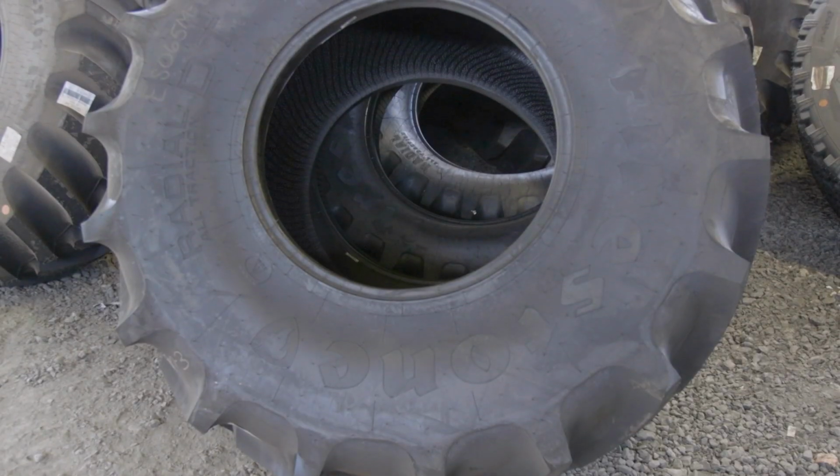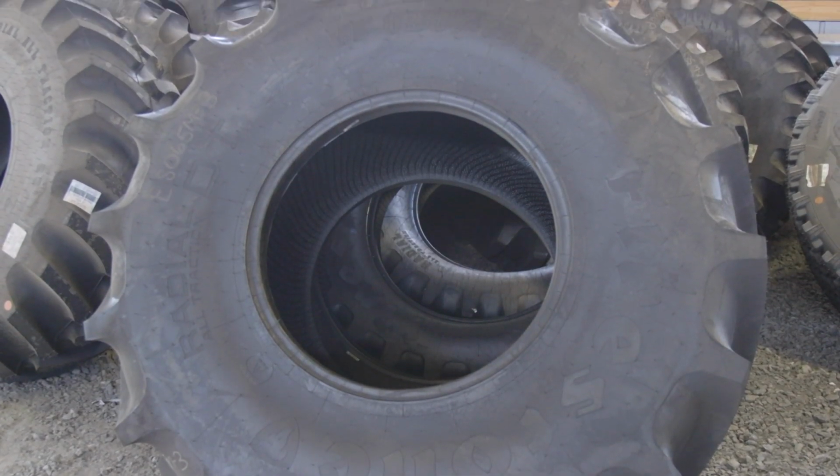When a farmer goes in to order a tractor, or he's putting new tires on his tractor because the old ones are worn, he's not being sold a bill of goods when the dealer says you really ought to consider VF. There is a reason why they're going to pay more for that tire, because the tire construction, the sidewall, for example, allows that lower pressure, doesn't it? In essence, our IF and VF tires and sizes are designed to run in an underinflated type condition. We've designed into the structure and the body of the tire the ability to run at a greater deflection, or greater squat, and carry the load appropriately and survive.